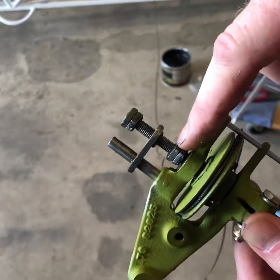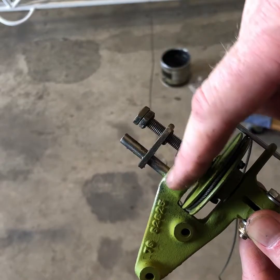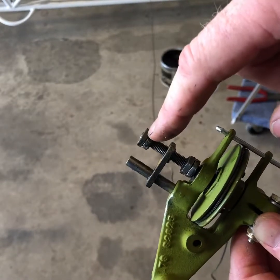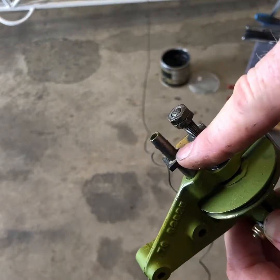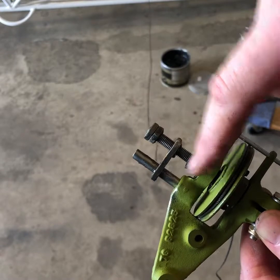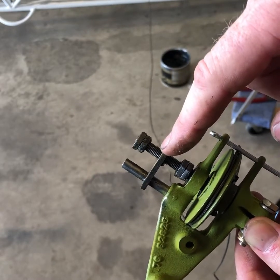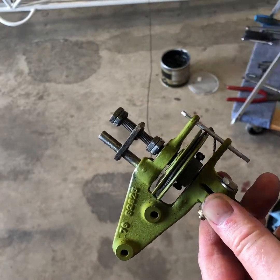The very last piece is this. There are two stop nuts down here, two stop nuts up here, and this plate. This post right here is not threaded, so there's an open hole there, but there is a threaded hole in this plate on this side. You take this tab and start threading it down, making sure that this hole goes over this post. This is your up and down limits — when you turn the crank all the way one way and it stops, it's hitting the limit here; turn it all the way the other way and it hits the stops. I'm going to leave this in the neutral place until we get to putting on the elevator and adjusting everything.